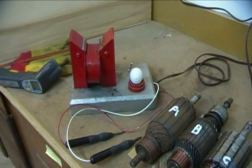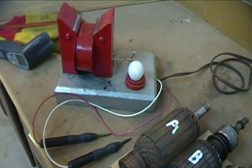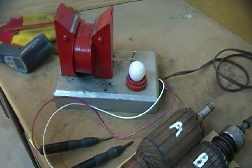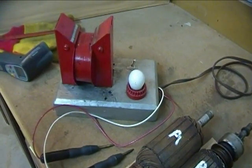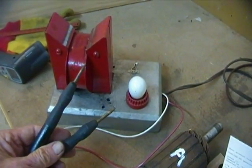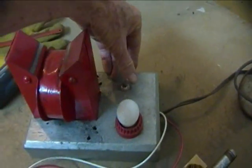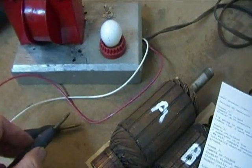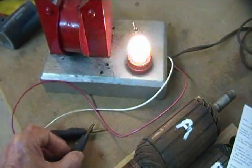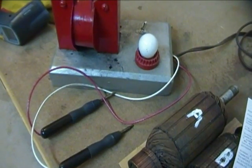Historically, growlers were used for a few other tests, most of which can be made with a modern low-ohms multimeter and really don't need a growler. In fact, most of the growlers I have seen use a current tester or continuity tester circuit which runs at full power line voltage, making them pretty dangerous if mishandled. These probes, for instance, are simply a continuity tester that turns on a light bulb when you short them together — not something you'd want to have your six-year-old kid play around with, that's for sure.